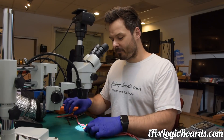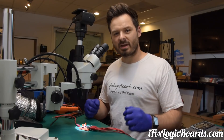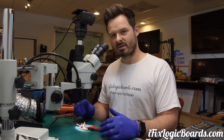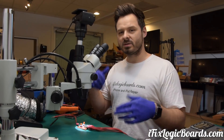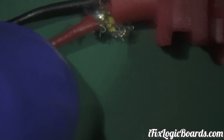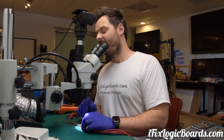This thing wasn't working too well for me, and I also saw some comments on Facebook groups like Repair Shopper, Shop Talker, Cell Phone Repair Shop Talk, and Introduction to Micro Soldering — pretty good places to get information when new tools come out. I saw a few people complaining about this. So I decided to open it up because mine was acting up — whenever I'd plug it in it would show a full short. Right off the bat you can see this is pretty terrible. This is one of the cheapest cables you can get, with thick braid, and the two insulations are completely ripped off and they were shorting together — that's why I had issues.